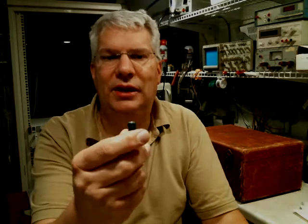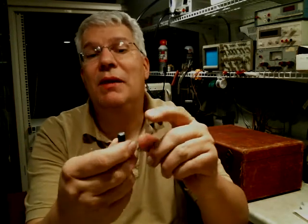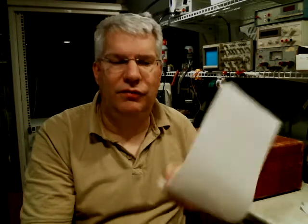So all I did was I looked around the power supply board, and I found this guy, pulled it out and put another one in and turned the printer on, and we were back in business. So if you have anything that looks like it's bad, just take it apart and look for these big electrolytic capacitors, and chances are it may be. I've had a lot of different motherboards and video cards and all sorts of different electronics have these bad capacitors, and I just pulled them out and put new ones in. So that was a fix, and that printer only has 3,000 pages on it. So I didn't want to pitch it. I mean, it's been a great printer.